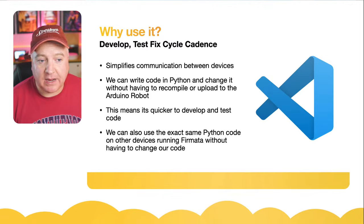So one of the things I would like to do with it is not have it physically wired up. So, excuse me, if I go over to here for a second, this robot has got a Bluetooth device, but currently it's connected via this serial cable to the USB port. So obviously when it's running on batteries, I actually don't want it to have this cable. I want it to use the Bluetooth device, and that just means that we need to change a small line of code, which is just this line here, 768 in that standard example, to be the second serial port. So I would just create a new serial port, configure that however I wish, whatever baud rate I want that to be. I think they recommend 57600, otherwise you have to change it on the other end as well, and that's quick enough to do everything that we need. So very easy for us to change it from the standard serial port to a Bluetooth one instead.